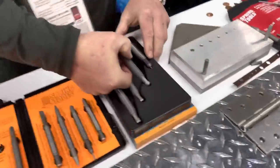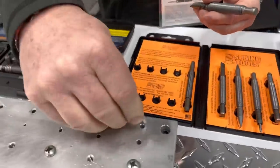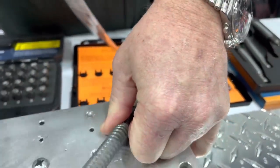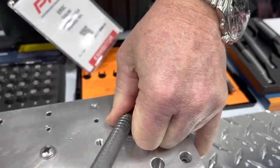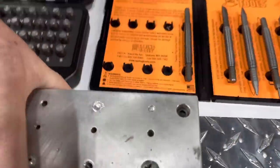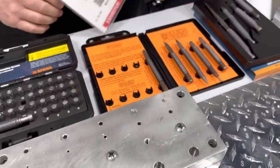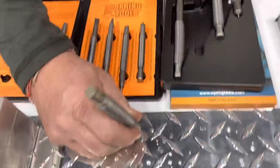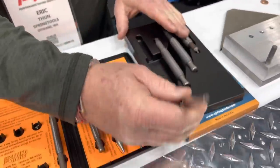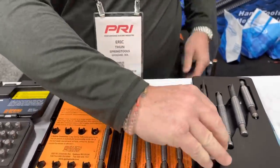The next particular tool in here is a cold chisel. I'll just put that in here — I put this rivet in here just to show you. If I wanted to shear off a rivet or whatnot, it just pops that thing right off. It's hard to demo because this moves, but it does a real nice job with that. And then a heavy duty center punch for larger jobs, and this is an all-purpose punch to knock things out.